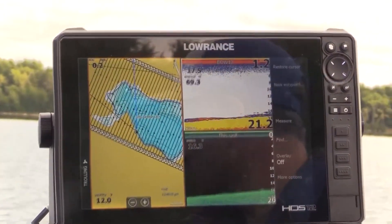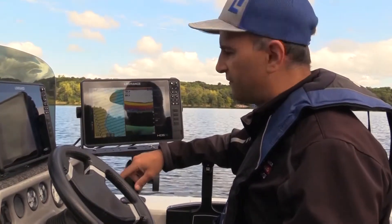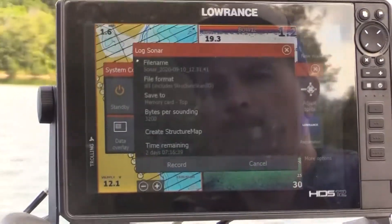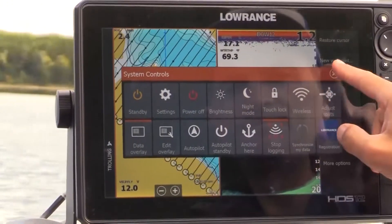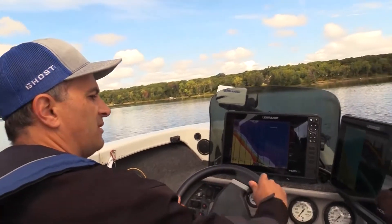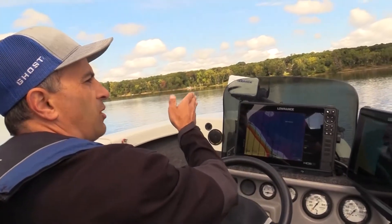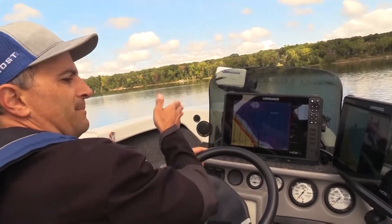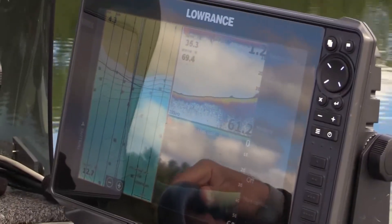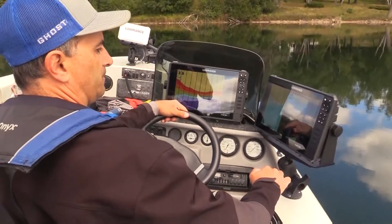There's our route. Depending on how large the lake is, you adjust your transect spacing accordingly. For this demonstration we have 125-foot passes. I'm going to start recording my sonar — SL2 — and now I'm going to start following these lines. Once I get a straight path I'm going to take landmarks on shore and use them to keep me straight. We're starting to come up the slope, so I'm going to slow down because wherever the bottom is changing quickly we want to go slow.